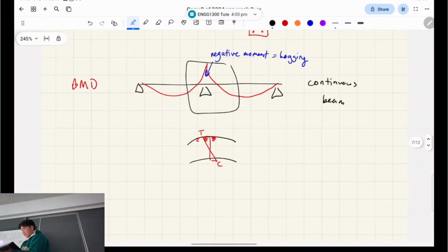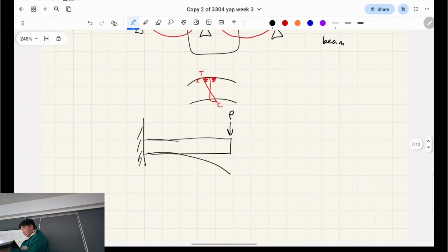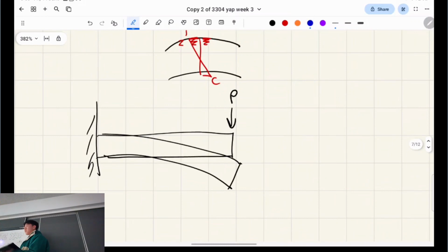Okay, so, another thing I wanted to allude to was cantilevers, right? Are you guys all familiar with the term cantilever? If I were to put a point load here, which way would it deflect? Okay, is the top in tension or compression? Okay, tension. Why is that? So basically the top is where you're going to see the cracking. Because if you see it flop like that, right? These fibers are going to pull apart and the compression will be on the bottom pushing together like that, right?